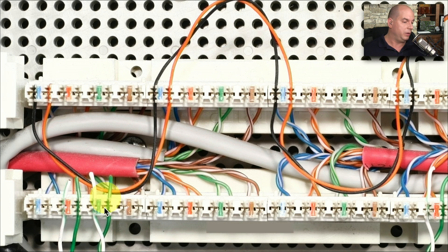Some of these wires were not trimmed with the punchdown tool — apparently it did not have the trimmer — whereas others you can see do not have that extra wire hanging off the end, and they've been neatly trimmed to the punchdown block.